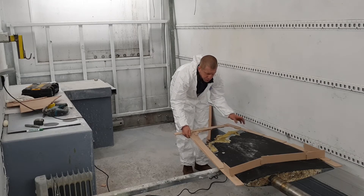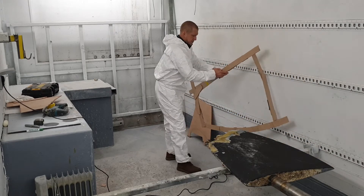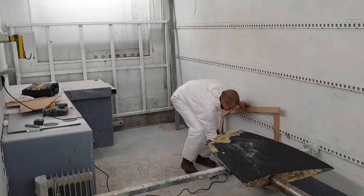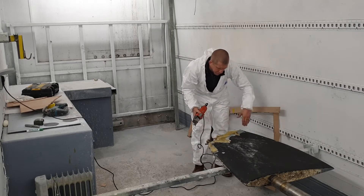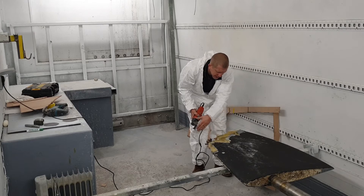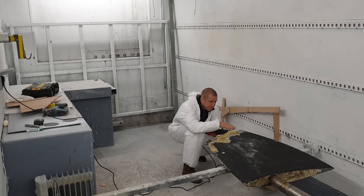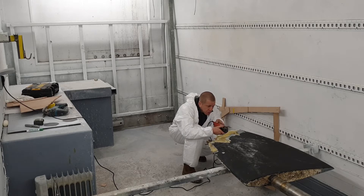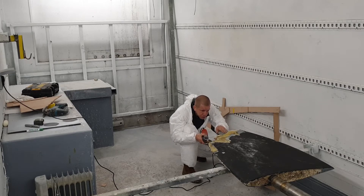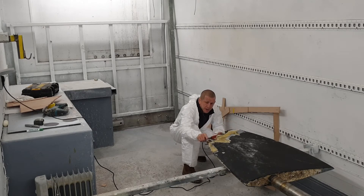So what we need to do first - I've got the band saw, cut the bottom off straight because it was all snarly and you couldn't really see what you were doing. Cut a nice clean edge across there, and then halfway down I cut out, again using the saw, a six mil groove all the way through. You can see that from halfway the rudder goes to a point, and you can tell we're halfway because the rudder stock is there - so that's always going to be in the centre.